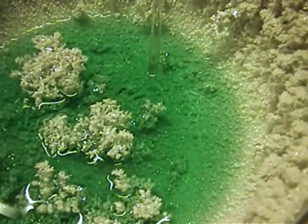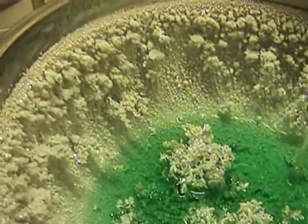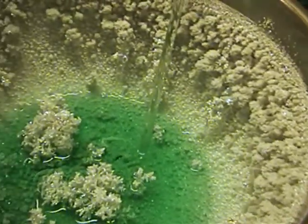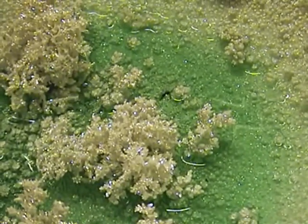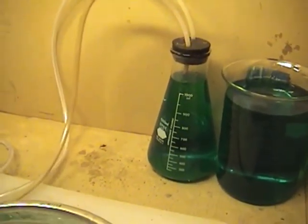We don't have but a couple hundred more milliliters of solution to go. Before I break these loose from the bowl I'll take my squirt bottle and rinse the crystals on the side, allow them to drain into the bottom so I can wash some of the silver nitrate from them. Then I can empty them from my bowl and prep them for melting, which we've demonstrated already. We're almost to the very bottom. Looking at my beaker in the back I'm actually just a slight bit over a thousand, so I guess I had about 3100 milliliters of solution in my silver cell.